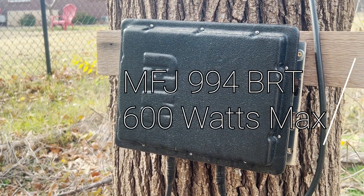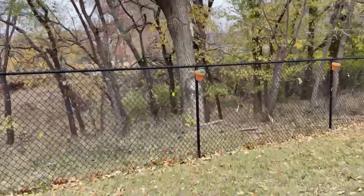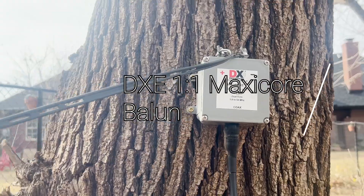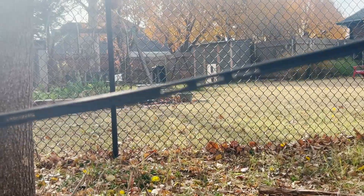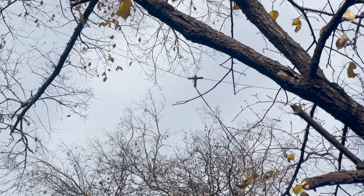I've loved that doublet. It can run up to about 900 watts through the MFJ remote tuner that I have. I've got that running to the house with some buried RG8U coax that somebody gave me — ancient stuff, but it works great. Then from the tuner out there, it goes up into the trees through some 300-ohm window line and then to the dipole. I thought my Chameleon MCOM 3B was impressive when I first got it, but that has nothing over the doublet. The reception reports I get everywhere with that are just incredible. That was told to me by my good friend and Elmer KX0U — he taught me about the power of the doublet.